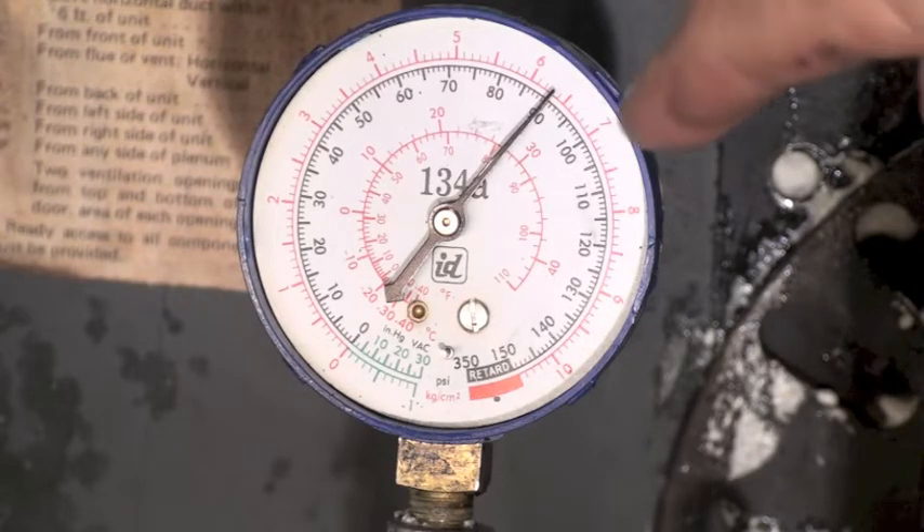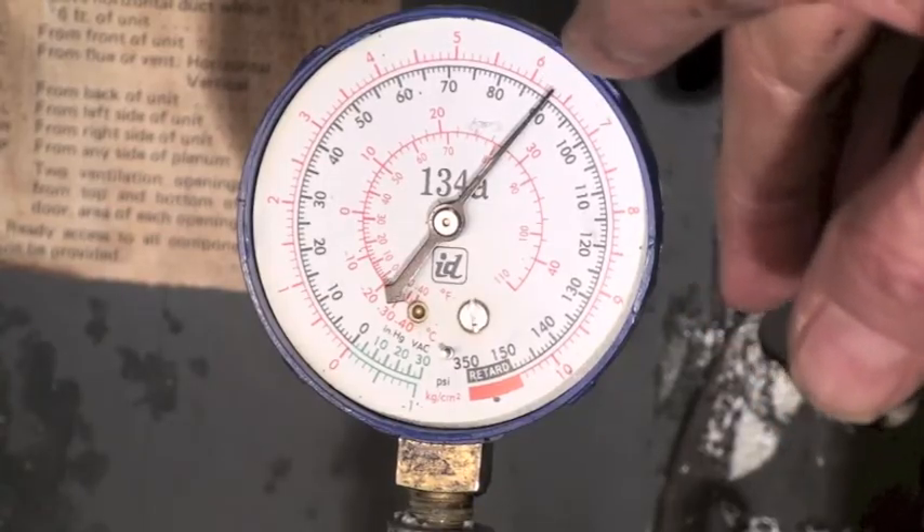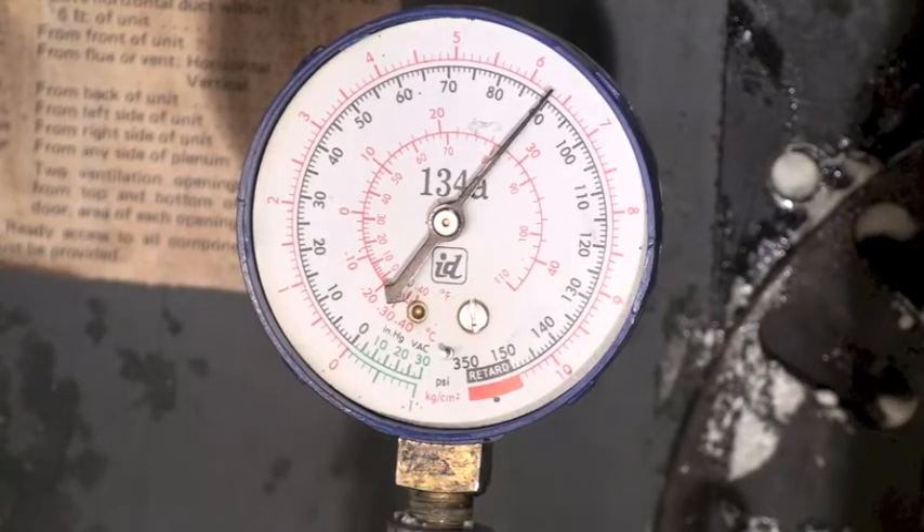They should drop off and hold. If this needle continues to move down and you don't have any leaks in your lines, if this gauge continues to go down after it drops that 10 to 20 percent — in this case it's dropping about 10 percent — if it continues to drop, the regulator is leaking by. It's just a question of time until that thing fails and you don't get anything at all out of this furnace. So that's the indication: if that pressure does not drop and stay and hold, then you have a regulator problem.